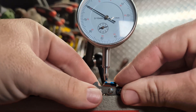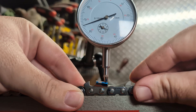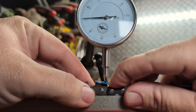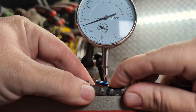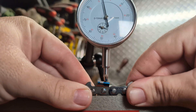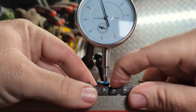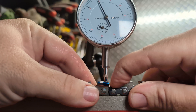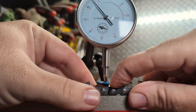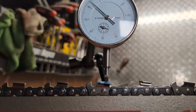At the front, if we pivot the back and give it a bit of a rock, you can see on that initial movement it moves up. If we go all the way to the rear of the cutter and do the same thing — anchor the rear — on that initial movement the gauge goes anti-clockwise; it is falling. I have marked a small line directly in line with the rear rivet — this should be approximately the dead zone. For the most part, that's its dead zone. So that was a problem Carlton identified.